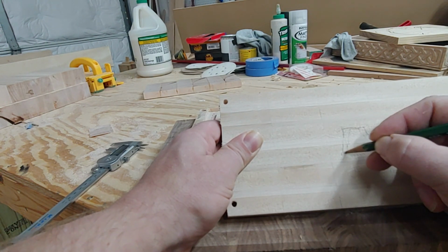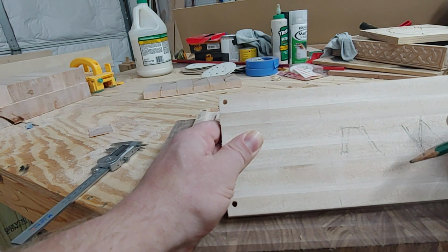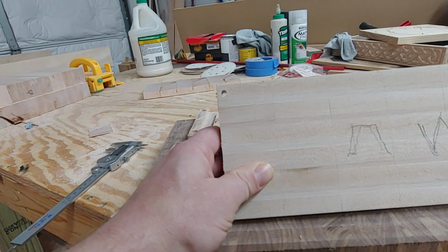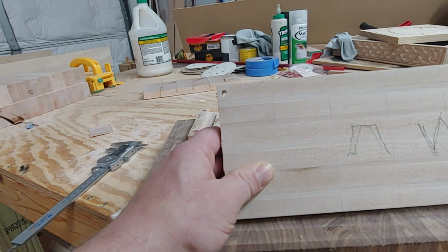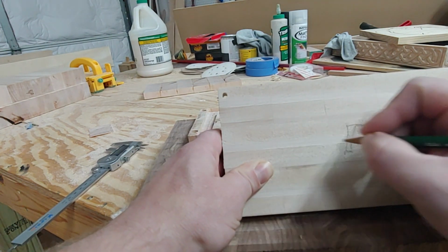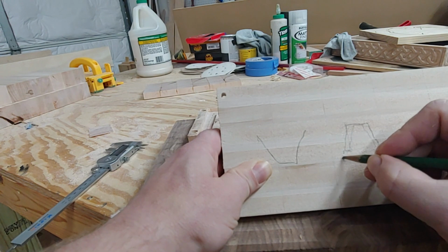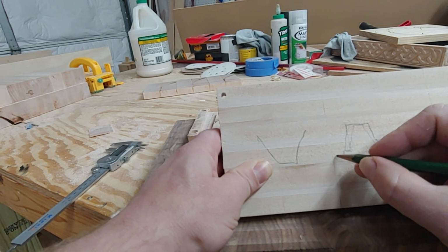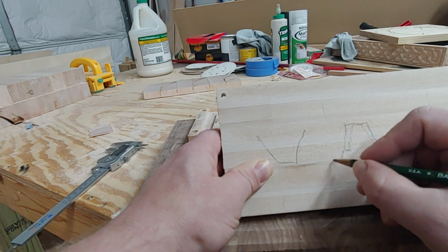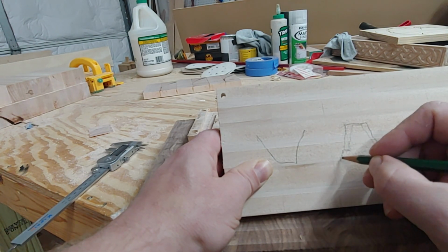So the more you drop the start depth, so to me, it seems like to get in a perfect world where every CNC bit carved exactly, and maybe if you can manage to protect the point on one of these 15-degree bits that comes to an exact point, you could do it this way. But if you could do a 1/4 inch female cut and then do a start depth of a 1/4 inch on your male cut with a flat depth of 0, which is, I think, impossible to do in Carveco, but I am going to test that out too to see what happens. Because usually when you do 0, it just thinks then there's no flat depth. And I don't know what that would do.